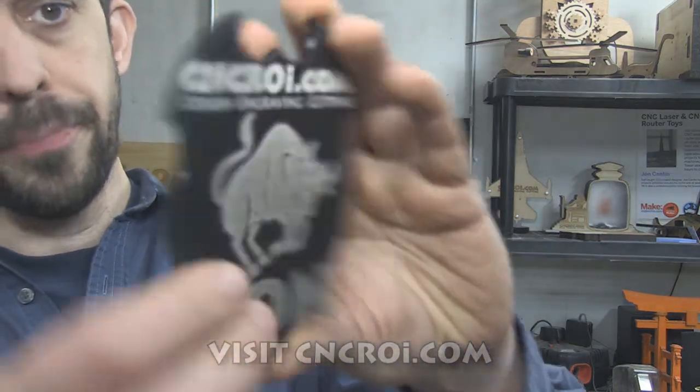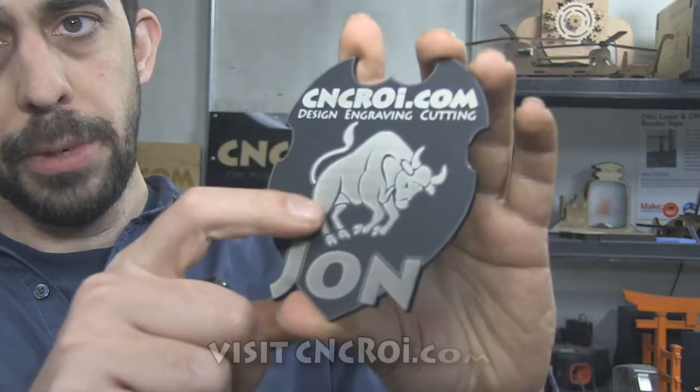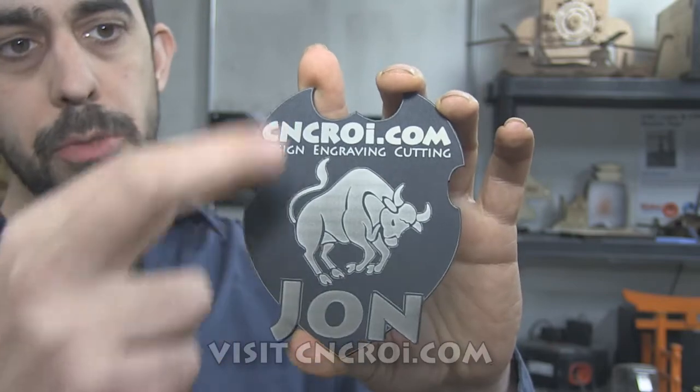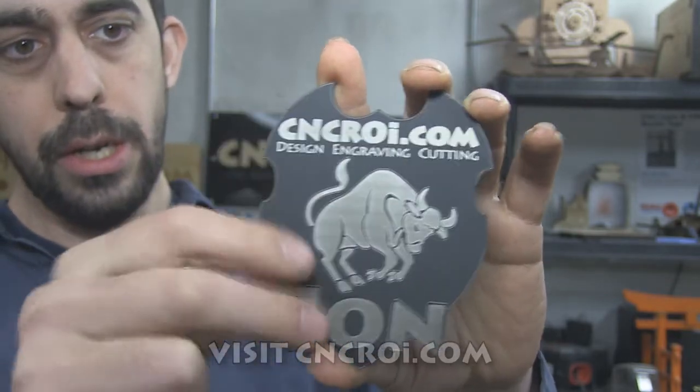It's very, very minor, but it's just enough to get things a little bit out of focus. That's why you see the variance here — because while the laser was doing the work, the plastic was slowly bending, the focus was changing, and thus you get a different result on the plastic.